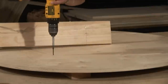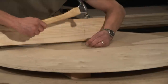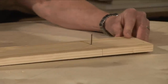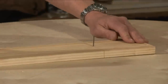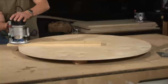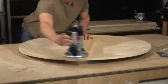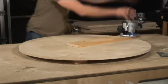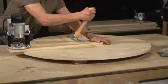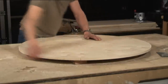Attach your piece of wood to your workbench and hammer another eight-penny finish nail into the center of your project. Line up your eight-penny finish nail with that new hole, hammer that down pretty secure, and then give it a little test. When routing on the outside of something, always make sure you go counterclockwise. Remove your jig and then just sand your corners so nobody gets a splinter.